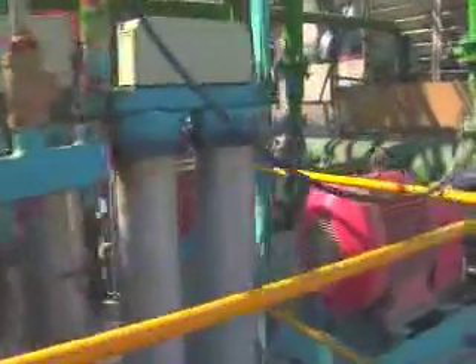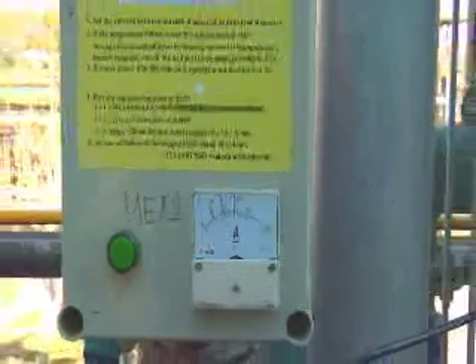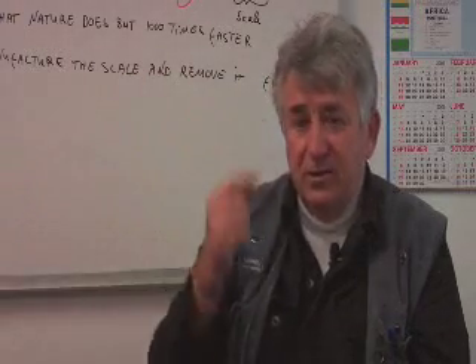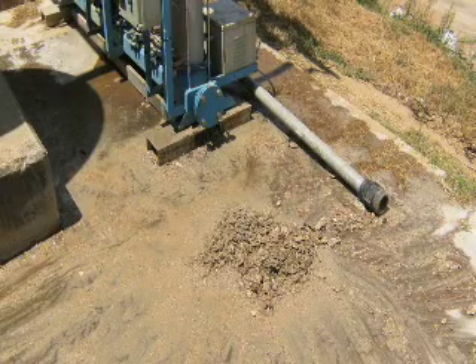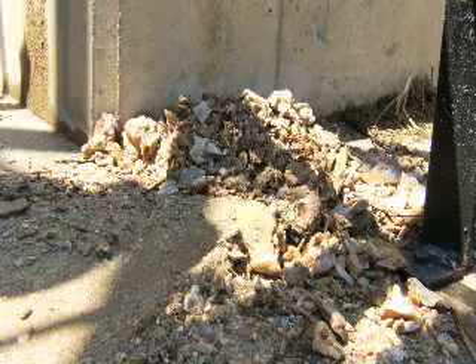All the indicators we monitor show that it's working and we're getting very good results. The amount of electricity we are using is about 200 watts per 50 cubic meters per hour — which is like the lighting in this room — or 400 watts when we are using it on a cooling tower. The system scales the calcium carbonates in its own reactor, not on the piping of the cooling system. So you force the scaling to occur in a place where you can control it, and not where you don't want it. By removing it you can recycle your cooling water for a longer period of time, so you don't have to bleed off to prevent too high a buildup of scaling.